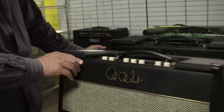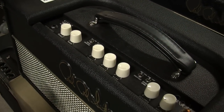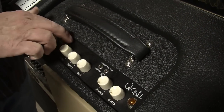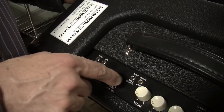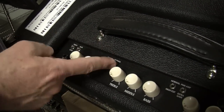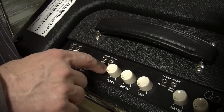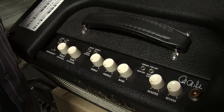This is our recording amp — one of our CAD amps. We released these at Open House a few years ago. Basically we gave you switches on the internal tones of the amplifiers: whether or not there was a cathode cap on the first two channels, a bright adder around the resistor going into the next stage, a cathode cap on the cathode follower, an option to take a little bit of high cut so it would sound sweeter, or change the feedback resistor inside the amp. What was really nice is you could get to those internal set tones and still have your tone controls.